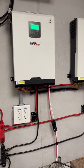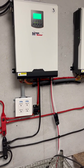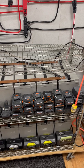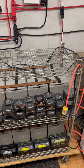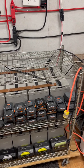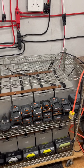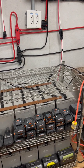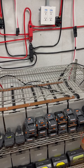Some of the differences: when I'm working with a 24 volt inverter I have to use two 12 volt 100 amp hour batteries in series to get that 24 volts. So I really only have 100 amp hours at night to use, not 200. To increase amp hours on a 24 volt system I'd have to have two sets of 24 volt batteries in parallel, but for four batteries I'd still only have 200 amp hours at night.